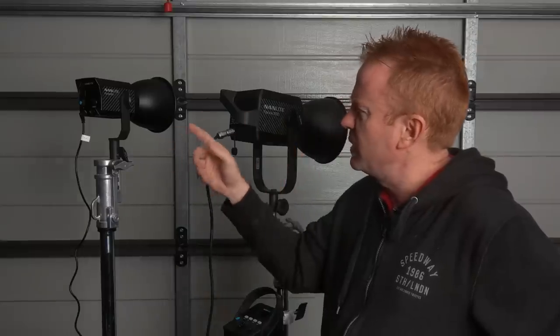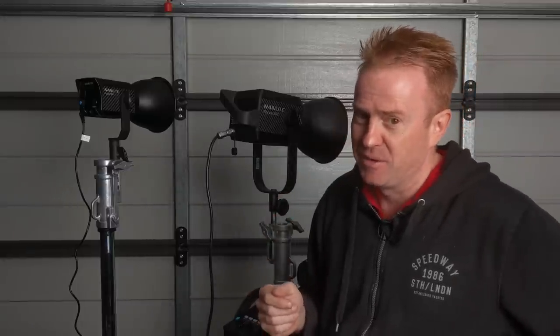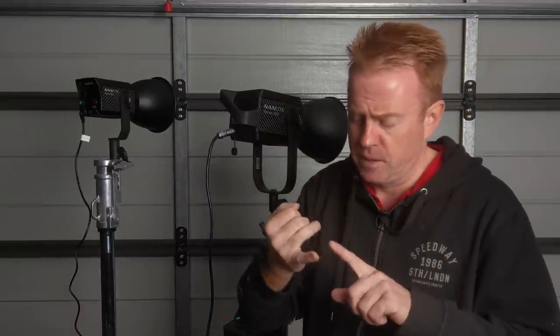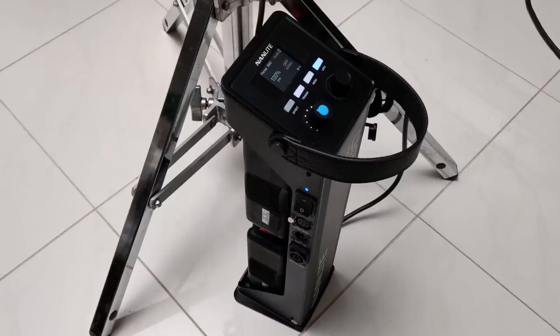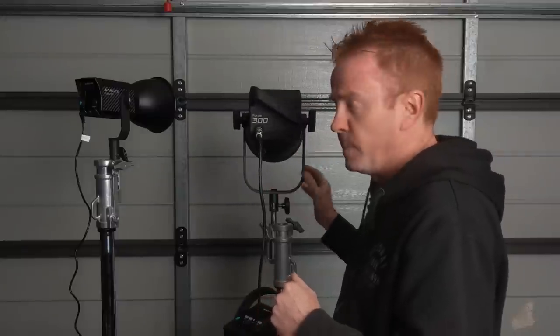What do I think of these lights? Well, having played with these lights for a couple of days, I've actually sold my Arri Pocket PAR 400s and my small HMIs, and here's why. Using the 300 as an example: no hot re-strike issues, no inconsistency of globe stock, dimmable, runs off V-lock batteries. And here's the icing on the cake — this unit is only 300 watts and it is brighter than a 575 HMI PAR.